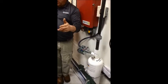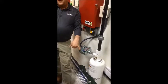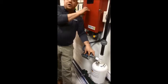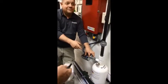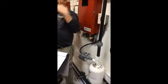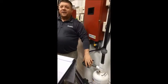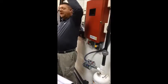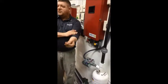You also want to make sure you give yourself at least 10 or 15 minutes after the last time you fired this — 10 or 15 minutes after the LED has been on — because if you build up too much voltage on the capacitor and you're totally clear, but you've got too much on the capacitor and you go land everything, you've dumped it, and you didn't even have any alarms. That's one reason why over the years I do my smokes and all the alarm stuff, energizing my release circuits, and then other stuff after — it gives time for the smokes to clear and time to make sure there's no voltage on the capacitor.